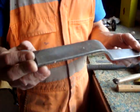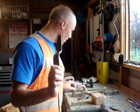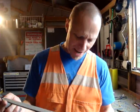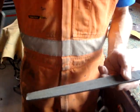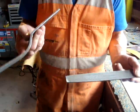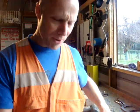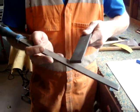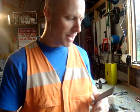So what we use here in New Zealand, let me introduce you to the slapstick. A slapstick is used for stretching out or lifting a dent up. I've seen them use flat ones on YouTube, but not here. In New Zealand, what we use — for example, this is a Nicholson Brazilian-made flat bastard file. You mark it out and bend it — heat it up cherry red and bend it — so that it can be held and used as a slapping stick on an angle. The reason down here in the southern hemisphere we use an old file: A, it's toughened steel, and B, these little file serrations actually leave a mark on the panel so you know exactly where you're hitting. And that's your guide.